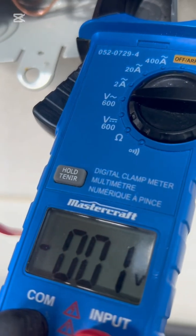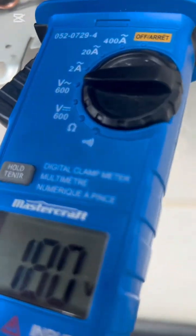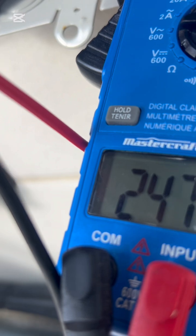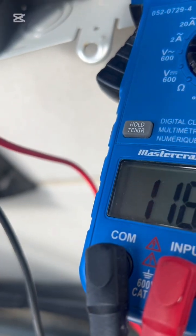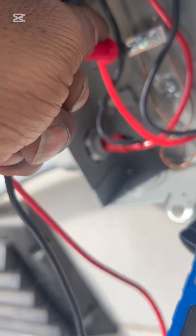Hello, let's dive into it. Today I'm going to be troubleshooting to see if my incoming power is going to come on. What I'm looking for is 240 volts, and then after I get my 240, I'm going to test to see if I have 120 on each line. That's normally how we go about our electrical troubleshooting.